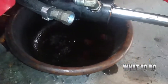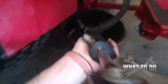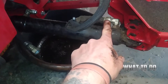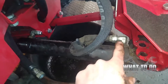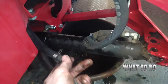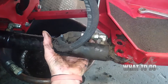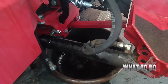No fluid came out of there, so that's good. Now we can pull this out and see how much room we have. I flipped the cylinder around so now I'm able to take this one off without it spinning around. Before you do this, this is where you want to mark — because both have the same fittings and you're going to get confused. Mark your hoses on which one goes to the rear and which one goes to the front. We'll call that one the front because this is the rear of the machine, and we'll call this one the rear — but remember you flipped this around so don't get confused.